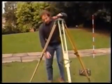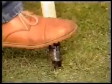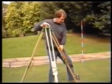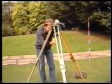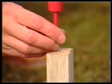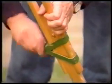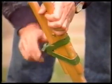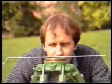While you hold onto the plumb bob, push the feet of the tripod into the ground. Be careful if the ground is hard. If one of the feet won't go in as far as the others, don't worry. Now suspend the plumb bob once more. Adjust the length of each leg to bring the plumb bob back to within 10 millimeters of the nail. At the end of this procedure, the tripod head should still be reasonably leveled.